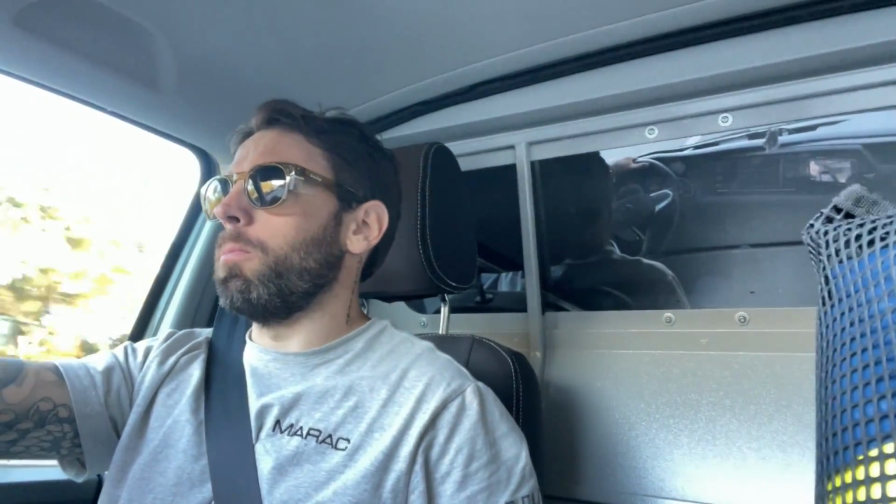So basically, a bit of a rundown. What I do is I run 12-inch ducts to all the living spaces and 10-inch ducts to all the bedrooms. The reason why I install that system as opposed to just a standard Daikin controller is, one, because it's got a way better app. The app is Mickey, but the main reason is just so I can change where the outdoor unit is sensing temperature from, and that's something that the Daikin Air Hub I was really disappointed in, that you couldn't change the location of where it's sensing temperature.